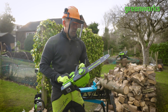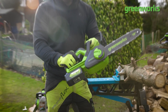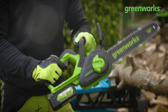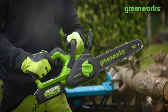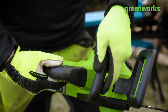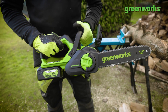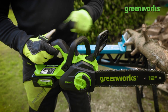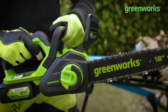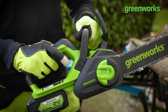When it comes to operating, it's all about being competent and confident with your chainsaw. A good confident grip on both handles — right hand on the lower handle, left hand on the top — then position the chainsaw. To activate: there are two triggers, one for the thumb and an underside trigger for the finger. But it won't start if the chain brake is engaged — think of it like the brakes on a car. Pull the brake back to release it, then repeat the trigger process.